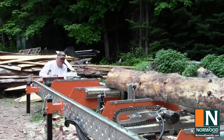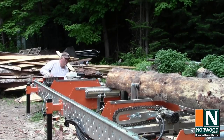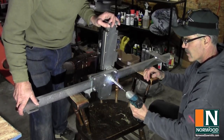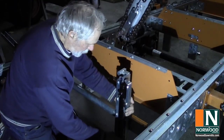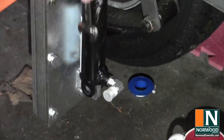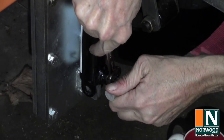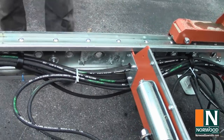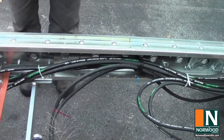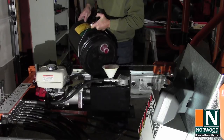The clamps also slide up and down as well as sideways to provide plenty of pressure to hold the log securely while you're cutting. All attachments come with the hoses and fittings. Norwood also supplies the clamps to hold them in place, but a few zip ties in strategic places also help. Finally, add a couple of gallons of hydraulic fluid to the reservoir and you're ready to try it out.